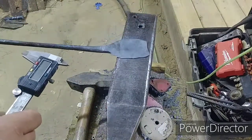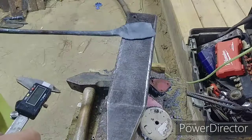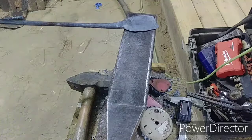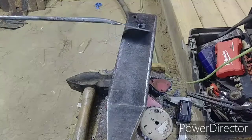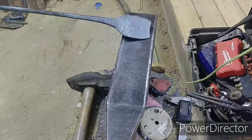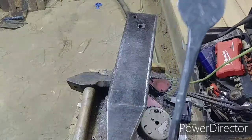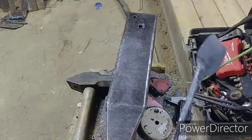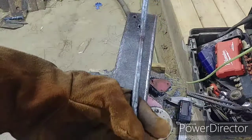I know this needs to be hardened so it won't bend, but I'm not sure how to do it. I'm thinking oil hardening, but the hardening needs to happen after it's been dressed up and filed down. Alright guys, it's your turn. I've talked enough. We're going to say this is going to be a little small pancake flipper. I do need to dress it up — there are some hammer dings. A rounding hammer would have been awesome, but I don't have one — I ordered one. It started out as half inch thick, and we've gotten it to almost twenty inches long, rounded out, started as a trapezoid.